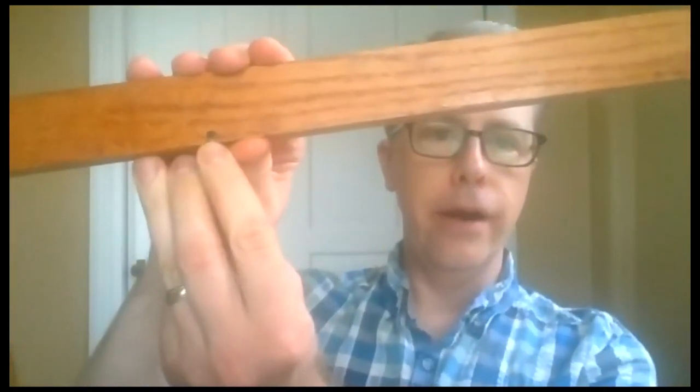Over to Josh. I also wanted to kind of go against the idea that winding sticks have to be pretty. Mine put the 'stick' in winding sticks — they're upgraded pieces of Instagram's favorite wood: Red Oak. They're simple one-by-twos with a couple of upgrades. I planed them straight on the top and bottom. Instead of having them angled, I just cut a rabbet in them and then ran a Sharpie in the rabbet. I marked the center of them and stuck the Sharpie in there.